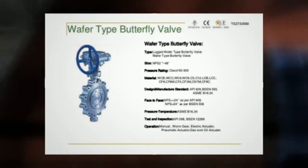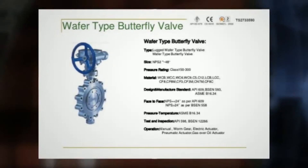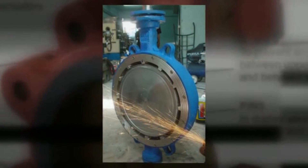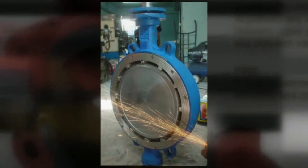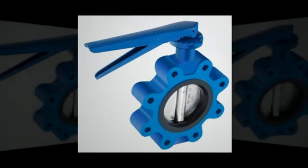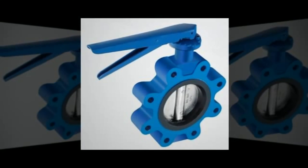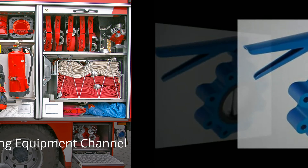The valve best suited for high-pressure systems is the triple-offset butterfly valve. In this valve the disc seat contact axis is offset, which acts to virtually eliminate sliding contact between disc and seat. In the case of triple-offset valves, the seat is made of metal so that it can be machined to achieve a bubble-tight shut-off.